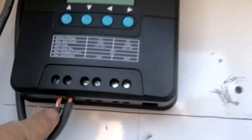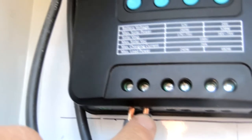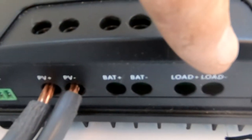Looks like I need to shorten that one a bit. When I put these in I tend to leave just a hair of exposed wire, and that kind of helps with cooling and things like that in case there's some resistance on the line. These two will hook to the battery and these two will hook to the power-over-ethernet injector which will be mounted right here.